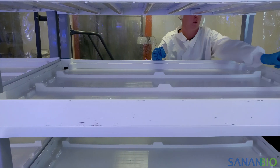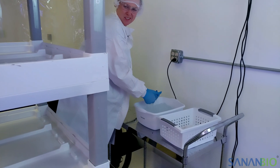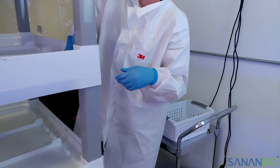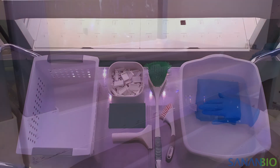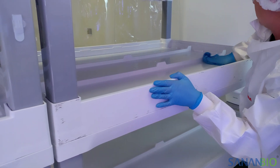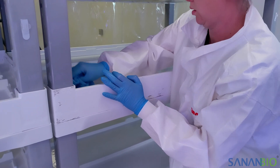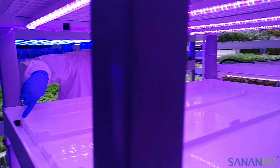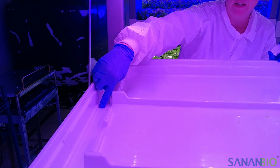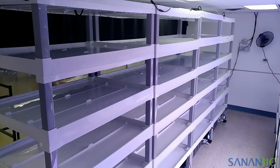This is a single radix so I have the ability to clean from both sides. However, many farms have rows of modules that are back-to-back. We recommend narrow-head, long-handled cleaning tools with soft to medium bristles when cleaning modules in this arrangement. After hand wiping, we prepare for a clean-in-place cycle to make sure the plumbing and reservoir get clean as well. To do this, we place one 25 millimeter dam at each grow bed outlet and refill the module and reservoir with water and turn on the pump.